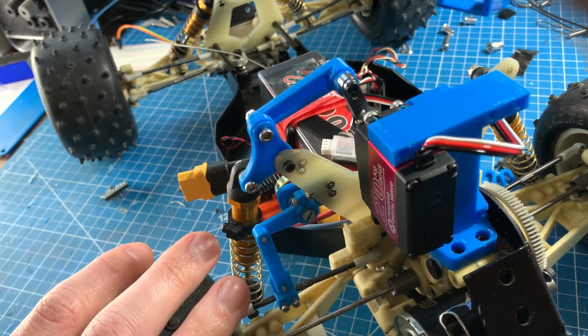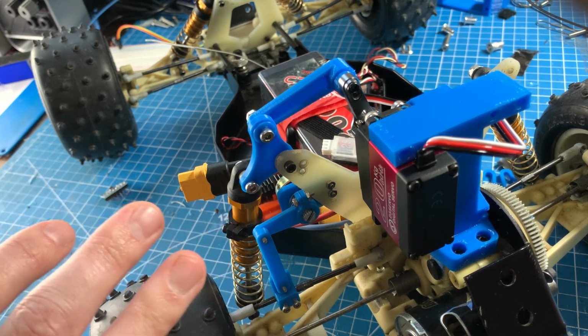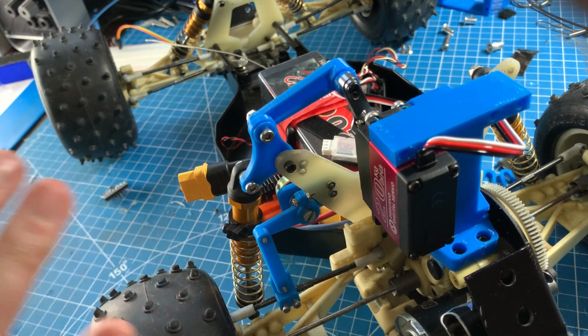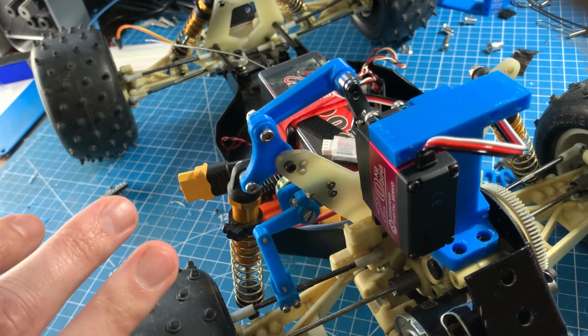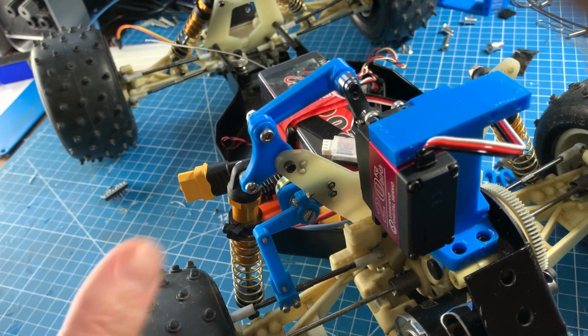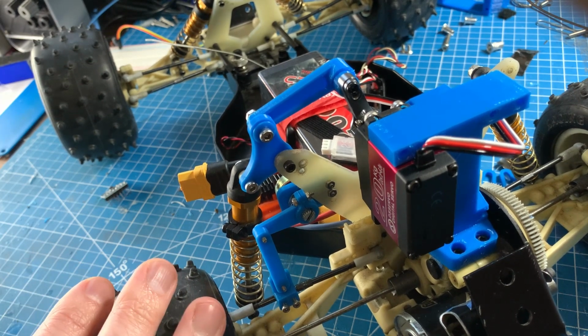The controller is going to be more complex than anything I've done before, and all the papers I've been able to find focus really on simulating a quarter model of the car, meaning that they just simulate a single wheel and its suspension. So I thought about building a test rig similar to what I've seen in these papers, but I just didn't want to go through the time of building a one-off test rig. So I'm going to go ahead and try to make a shaker rig that initially will be just for a single wheel, with a motor and an eccentric that allows me to vary the frequency and test different control schemes.